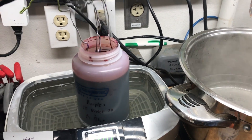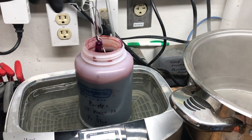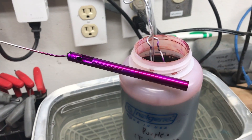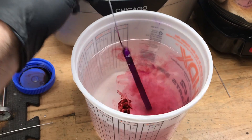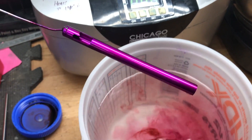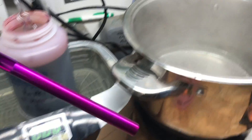After 15 to 20 minutes, take the parts out. You can see the color is a pretty nice shiny purple, then rinse it off. If the dye is maintained, you know everything worked. Just stick it in boiling water for about 15 to 20 minutes to seal the pores.